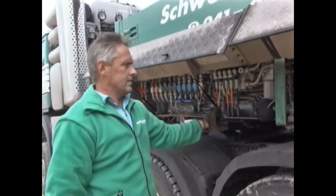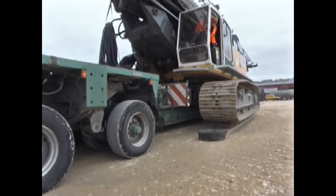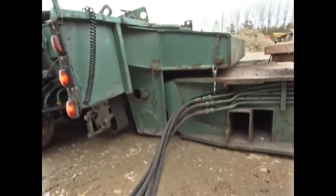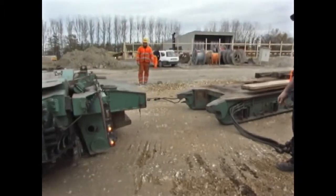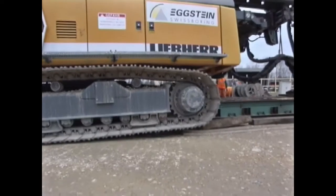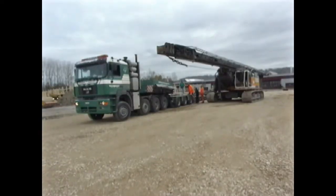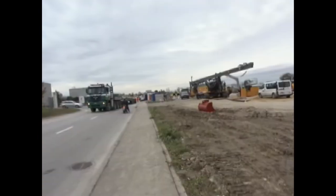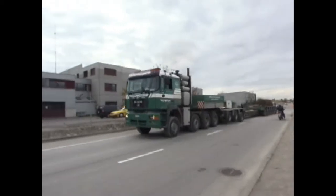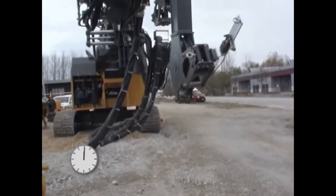For pile installation, ring vibrators are used on Liebherr carrier machines. The compact transport dimensions and the quick and easy assembly of the LRB machines allows for their flexible application. Thanks to the hydraulically adjustable leader, the vibration pipe can be perpendicularly aligned in all directions, even during the installation process.